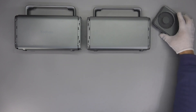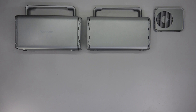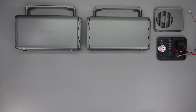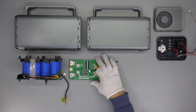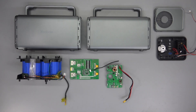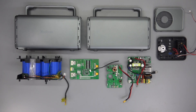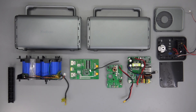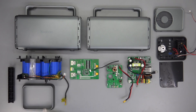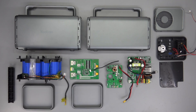That's all the components of this Yubao 300W power station. It can be divided into three modules inside, which is convenient for assembly and maintenance. The battery pack consists of 12 lithium iron phosphate batteries. The battery output and inverter input ends are soldered with fuses for overcurrent protection. The all-in-one SOC chip for buck-boost control and protocol identification greatly simplifies the circuit, and an integrated cheap-cost MCU controls the power station. If you like this video, please drop a like, leave your comments, and subscribe to us. Your support is what keeps us going. See you in the next video.